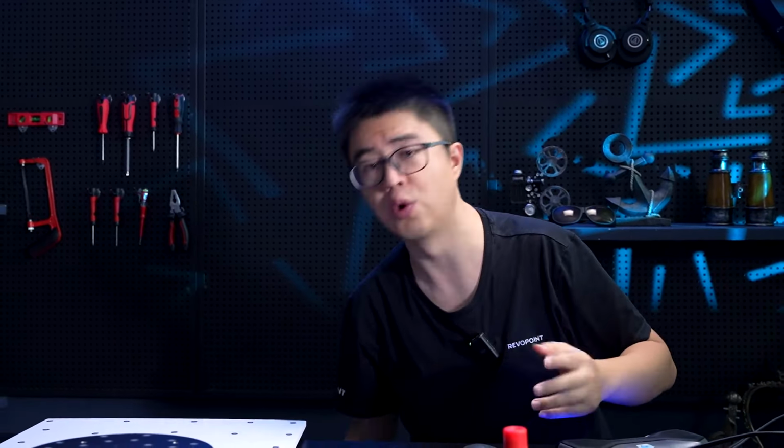Cross line, no problem. Object type: to scan something dark, we choose black object. And what you can do is increase the depth exposure to 2 or 3. 3 looks good. Okay, might want to stand up a little bit. With a turntable my life will be much easier. I don't have to do the swing like that. I just comply with the turntable and be good.